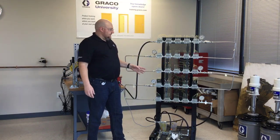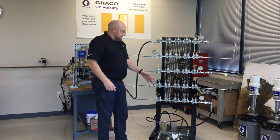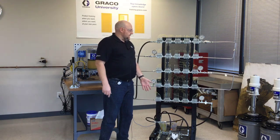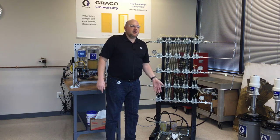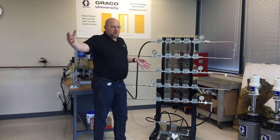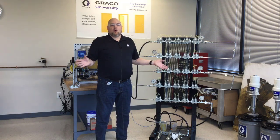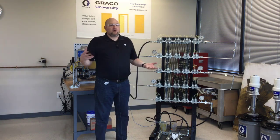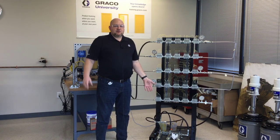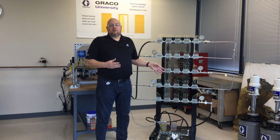These last few are just resetting now and it seems like about the same amount of time as it took with the GL11s. Having a bigger injector at the end will help ensure that your smaller injectors are able to fire even at longer runs. You should never design a system to need that, but if you set up a system with GL32s and it won't reset — maybe the tubing's too small or the grease is too heavy — you can put a GL1 or GL11 at the end. The stronger spring there will get the grease moving to vent and help them all vent more quickly.